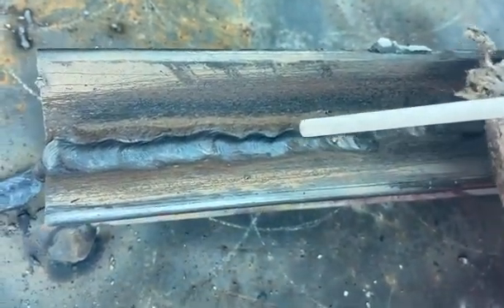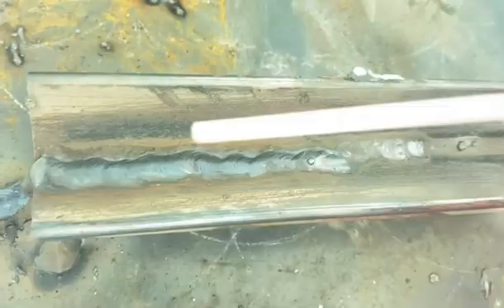Don't get discouraged — we still have more time and we're able to fix it as we go. One of the goals, as you can see in the diagram I'm drawing out with my soapstone, is that you have to eat half of the previous weld. That's what stacking beads is all about — you eat half of the previous bead and make a new bead, and each next bead eats half of the one before it. Don't forget your electrode angle, distance, travel speed — breathe, relax, and pay attention to all these things.